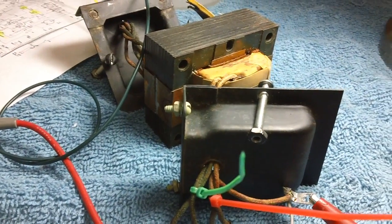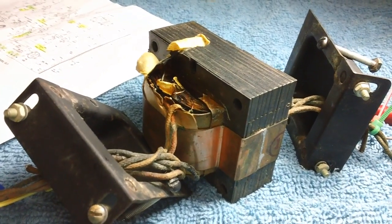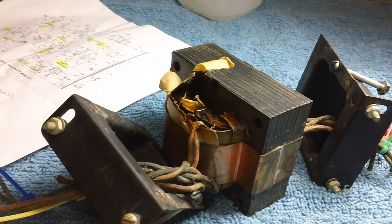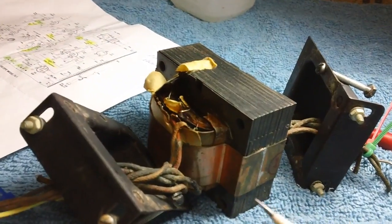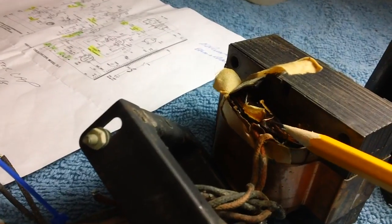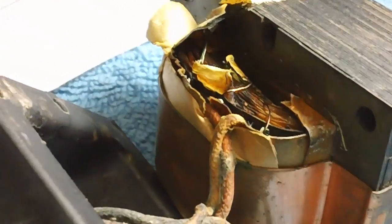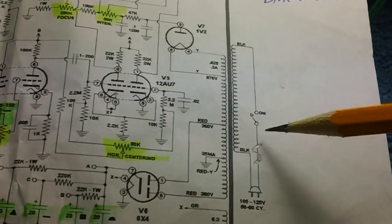Let me think about this for a minute. I'll tell you what I'm going to do. I'm getting a lot of feedback about how you always learn from my videos. You want me to keep doing more, so you can learn more. Well, I've done a lot of videos, guys. We've got all of our wires intact, as you can see. Let me zoom in. We've got continuity on all the coils. No continuity between any of the secondary coils and the primary coil of the transformer.